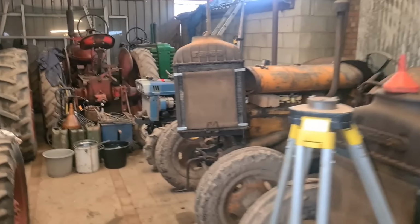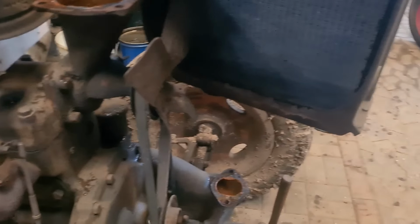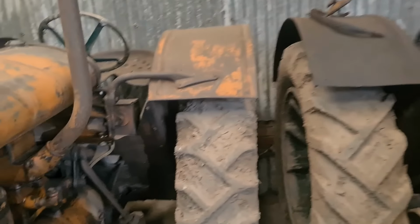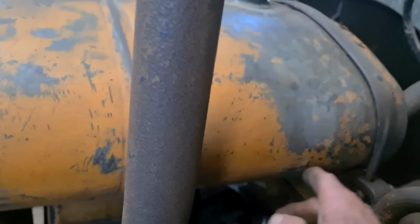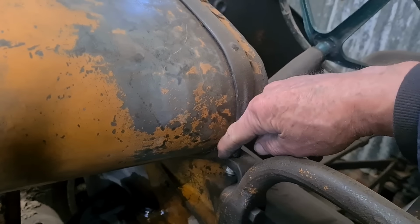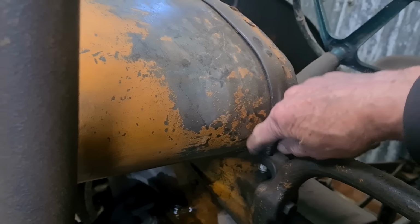Okay, so I've got the radiator lifted off. That's all good. I'll move right out of the way in a minute. So what I have, see the damp patch? Now we've disturbed the tank, you can guarantee there's a pinhole where it sits on the ledge, on the bit of felt, and obviously now we've disturbed it, it's leaked.